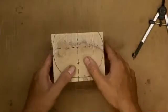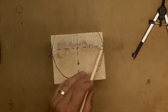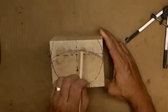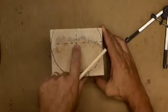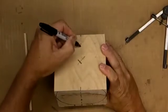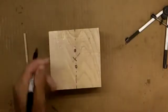And my solution for that is to drill holes and use dowels. And it's real simple. If you're looking at the arc here, if the dowel lines up with the high point of the arc, it's where it's the flattest rather than being curved and close to the edge of the bowl. And it has to work the least amount of distance. I only have to get it to here. So I'm going to take this line and basically establish it on the top of my bowl. And then just inside the bowl that will get turned away later, we're going to drill holes for dowels.